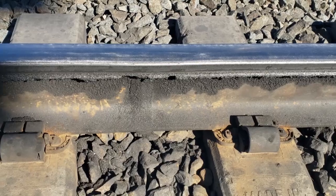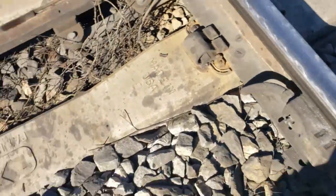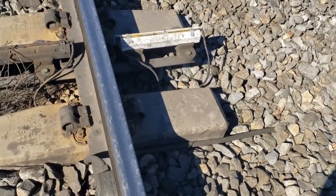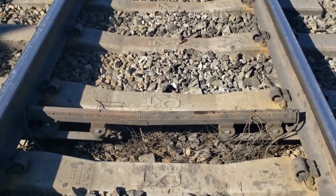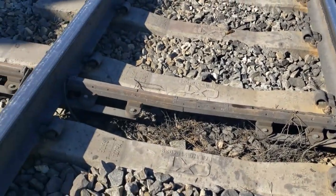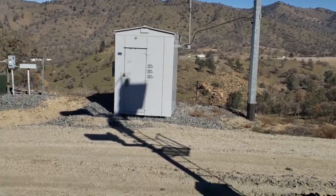You can see where that weld is on the rail — kind of got a lot of grease on it from the oilers. That is a transducer, and there's another one just like it on the other rail. Those are used for these smash-board type dragging equipment detectors. Wires plug into each end of these boards, and if the boards are broken it breaks the connection between the wires and sends a signal to the radio, telling the train they have dragging equipment.